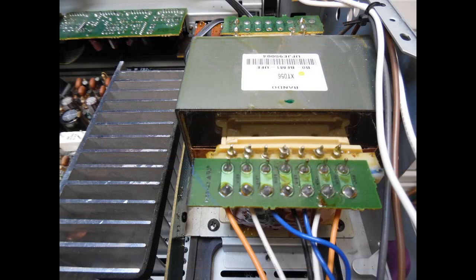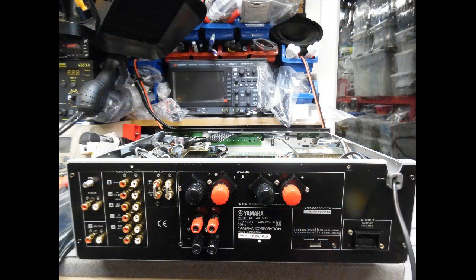Next I'm showing the rear of the amplifier. I really like the extremely robust speaker terminals — speaker set A and B are clearly indicated. There's also a switch below the auxiliary power socket for selecting impedance depending on your speaker combination. The user manual advises depowering the amplifier before moving that switch. You can also see the preamp output and main input coupler, the phono connection with its ground, and then the CD and all other inputs.